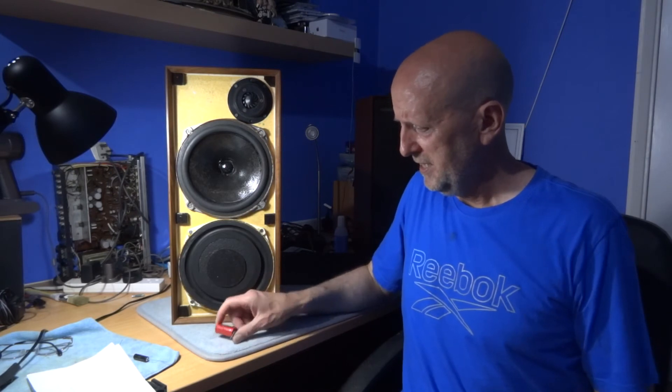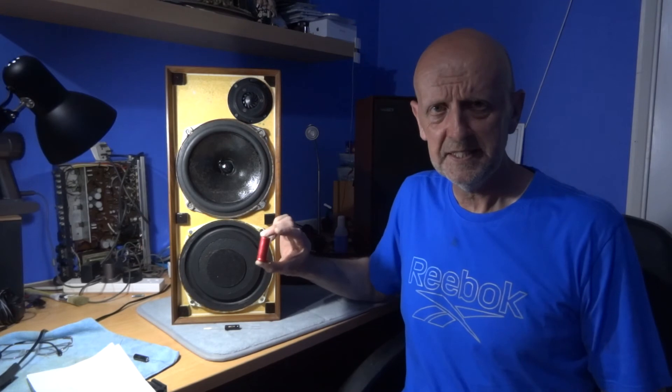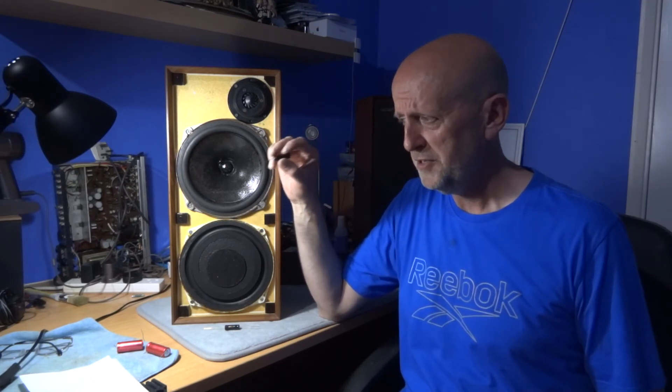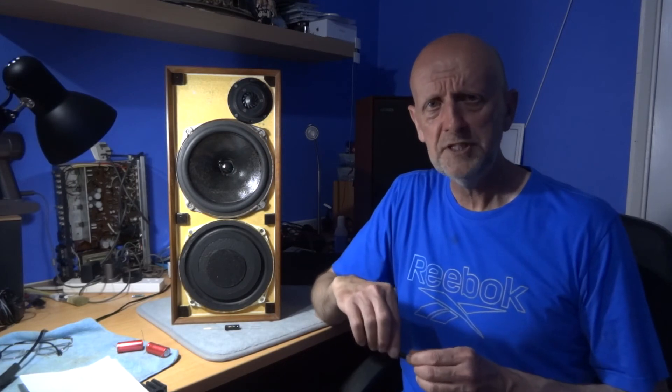So that brings us back — front back on and we're back to how we were. Did I notice the difference? First of all, I measured the old capacitors to see what their capacitance was. One measured 11.68 microfarads and the other measured 13.66 microfarads — so nearly 2 microfarads difference between the pair. The new capacitors, even though they're rated at 12 microfarads, measured 13.44 and 13.46 microfarads — pretty much a matched pair. I still have two spare ones, as it was cheaper to order four with next day postage than just two.